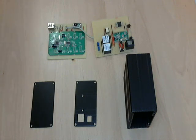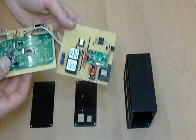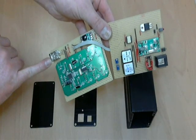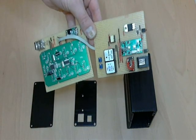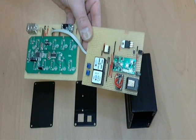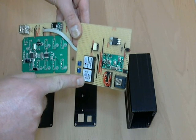Over the past couple of years I've been doing some ROIP using a VOX-based circuit. What I've got here is a new interface I've made. It has a USB input and output for the radio. The key difference is that it's entirely COM port keying — there is no VOX whatsoever. This is a proper COM port keying device, suitable for things like Free Radio Network.